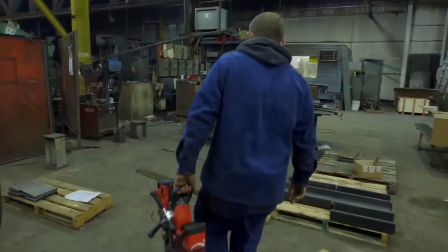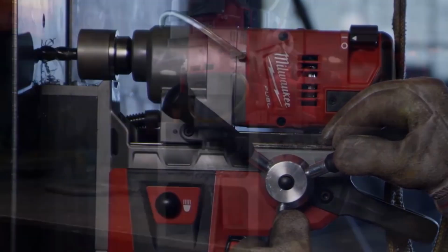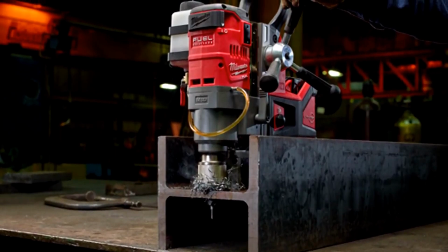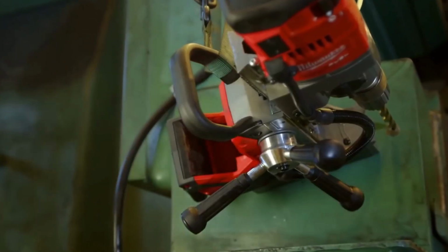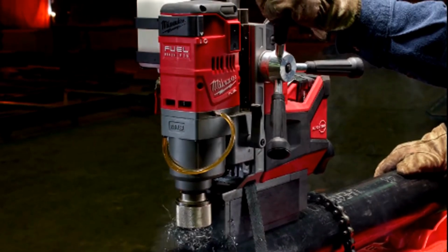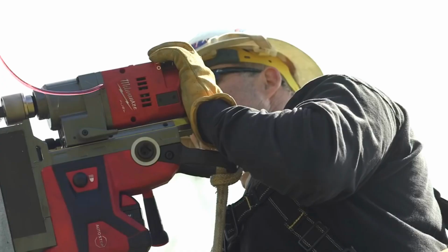The operator needs only to accurately set the tool on the surface, start the drill and immerse the drill or cutter in the metal. The drill provides strictly perpendicular immersion of the cutting tool. One battery charge is enough to drill 40 holes with a diameter of up to 0.8 inches in 0.3-inch thick steel. The drill is equipped with a water cooling system and a brushless 18-volt motor whose torque and speed are not worse than network analogs.